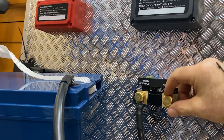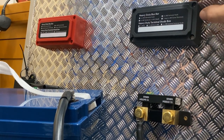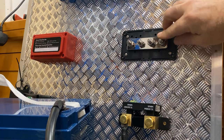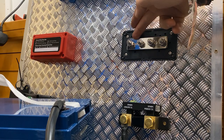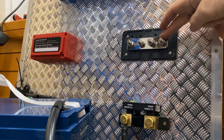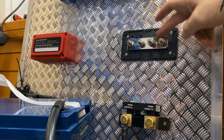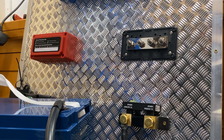The other side goes to your system - it says 'to system' on here. We use bus bars. This bus bar has got four posts so you can connect all the system negatives to it. These bus bars are rated for 300 amps. If we're not using these, we'll use a Victron distributor or power-in, something like that. They've got four M8 posts. All the negatives for all items - the MPPT, the Orion, the fuse box for the whole system - every negative goes through this. Now we need to connect the shunt to our bus bar.